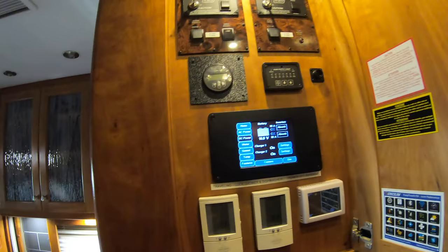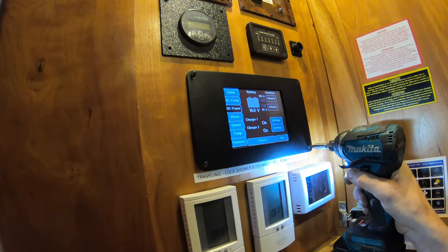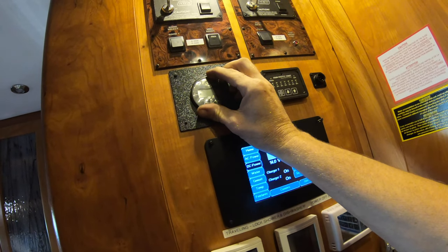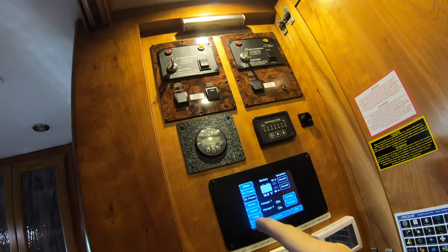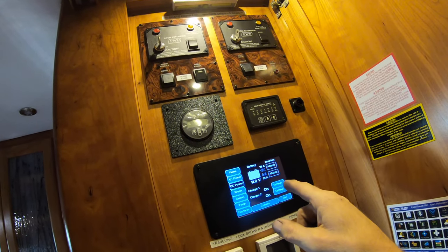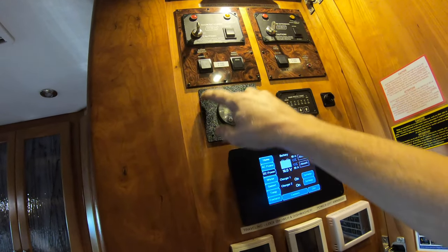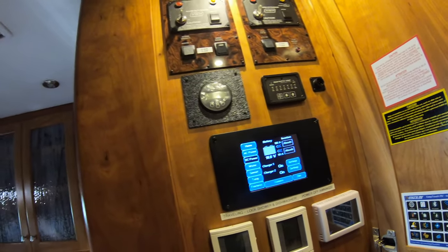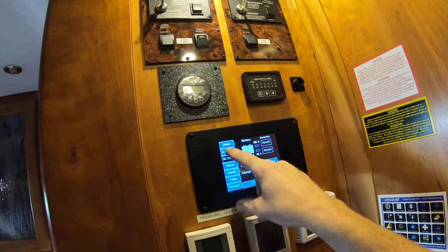The Silver Leaf components are installed downstairs. I've come inside and I'm tightening up a couple of screws to get the display secured in the cabinet. He changed out the factory solar panel controller for a Victron because he did the lithium-ion batteries — so the inverter is set for lithium. He's got his new display here; we made this panel out of a piece of ABS to fill the void. The display is showing: charger on, absorption charge at 14 volts, AC power.